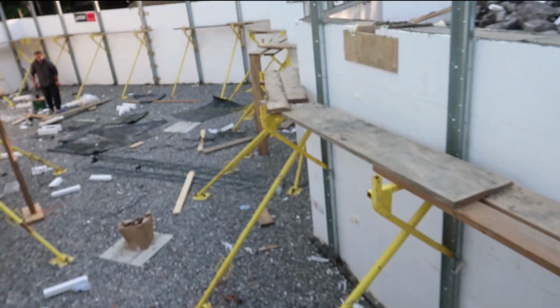So anyways, that's why we're taking apart the bracing. The bracing for the actual walls has to stay up at least 24 hours. We would like to do 48, but we don't have 48 hours. So 24 hours, but Kyle is taking down the scaffolding part, which is the part you walk on, and then the hand railing, because all of that doesn't need to be up there to actually brace the wall. It's all of these angle pieces that brace the wall.